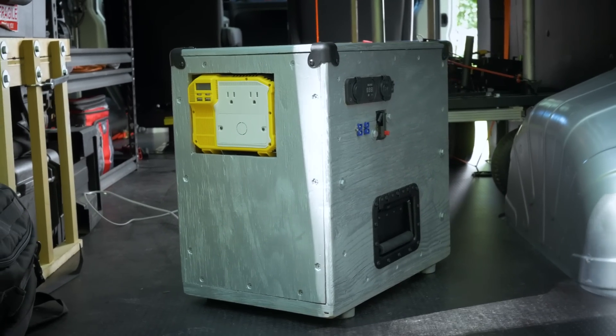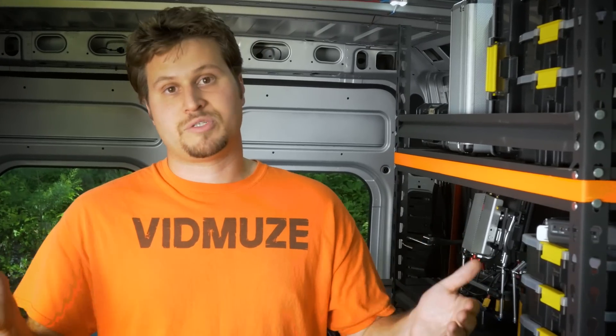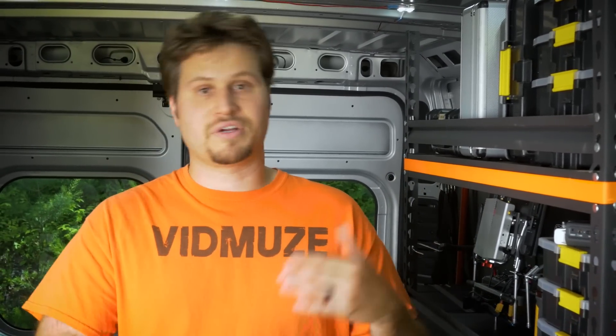The box also contains an inverter — this is where it converts DC power to AC power. We have a 4,000-watt inverter in there. Now, yes, that's overkill; there's no way we're going to be pulling 4,000 watts. We had other plans for it — basically going from DC to AC back to DC by hooking up our power supply to it. But we just thought, let's be smart: DC directly to DC and forget the conversion.